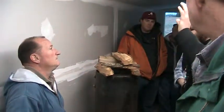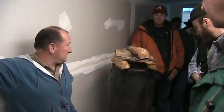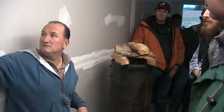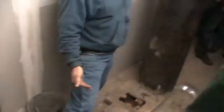In Michigan, they say you've got to go two feet higher than the highest point in the building, and then you've got no problem at all ever. What we're sending out is mostly CO2 and steam by the time it re-burns. We're still peaking out 80 degrees there, and even here we're 190 at this point. If this is starting early in the morning, this entire surface — all this concrete — will absorb that heat and radiate back up to help keep the fish tank water warm through the next 12-hour cycle when we're not burning.